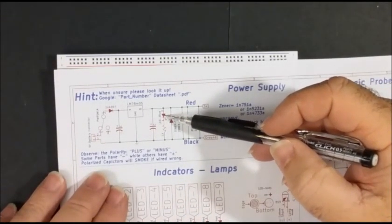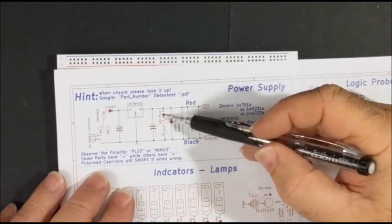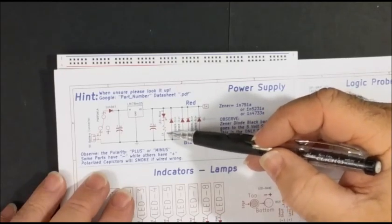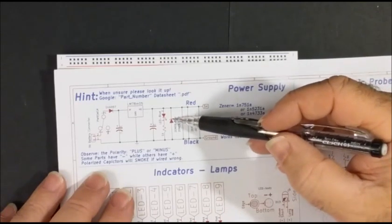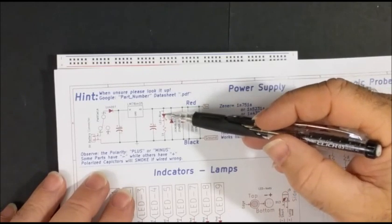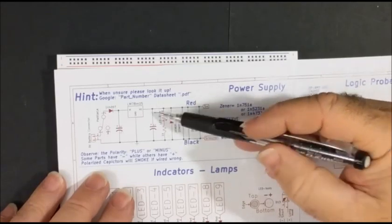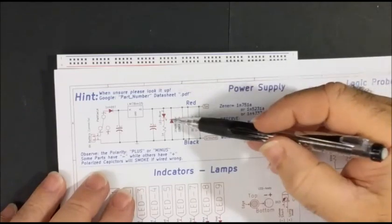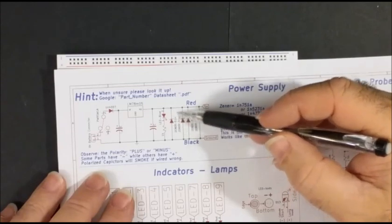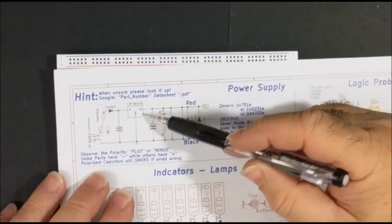This here is a light emitting diode. I have blue here but we're changing this to white. So this will be a white LED and a 1 kilohm resistor. These are your Zener diodes — you notice the bands are in the opposite direction. The arrow is the direction that the current flows. On the Zener diodes, we have them wired up backwards. So when they turn on, they will only turn on at 5.1 volts, which is higher than the output of this voltage regulator.